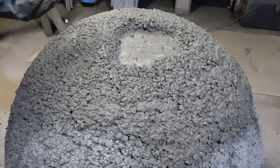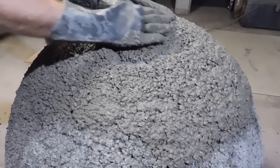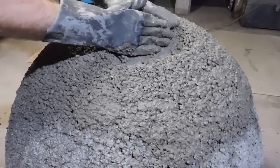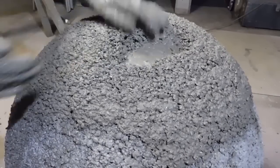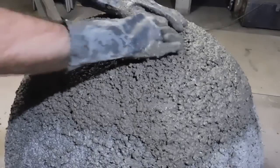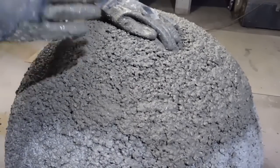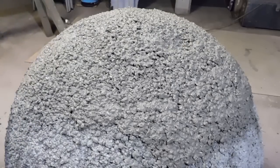This thing's taken about 40 litres, which is about 9 gallons, about 1¼ to 1½ inches thick, 35 mil. I'll leave this for about 3 days, then I'll roll her over and let the air out. In the meantime, I'll cover it with some damp towels or rags and cure it slowly.